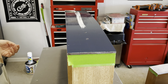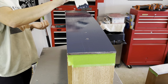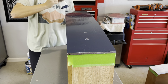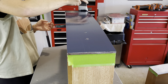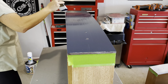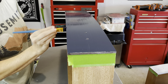I thought I was recording and I really wasn't, so I just now hit record and I'm putting on a layer of paint on the drawers. You're just going to see me getting some paint on the drawer first, making sure I get paint across the whole drawer. You have to work pretty fast because this paint does start drying quickly. Once I get a good coat of paint on, I'll go back and start on one end and just sweep all the way over from one end to the other to get a good even coverage. Once I do that, I just leave it alone — I'm not going to keep going back over my brush strokes, because that's when you're going to start getting streaks.